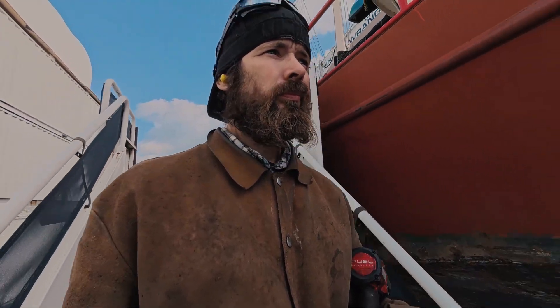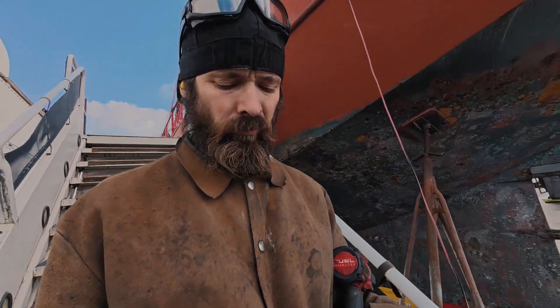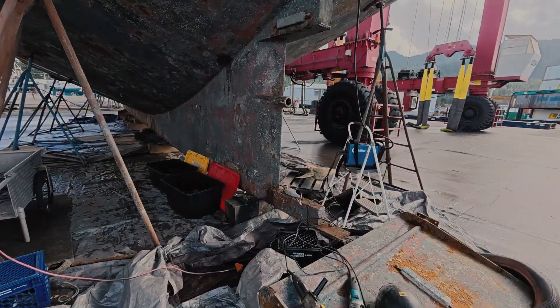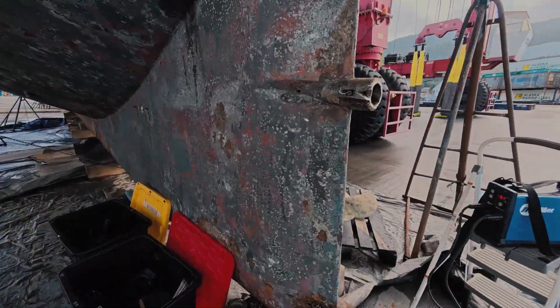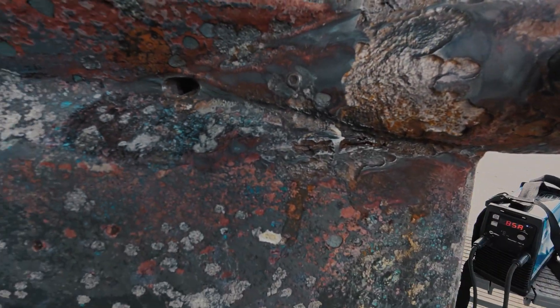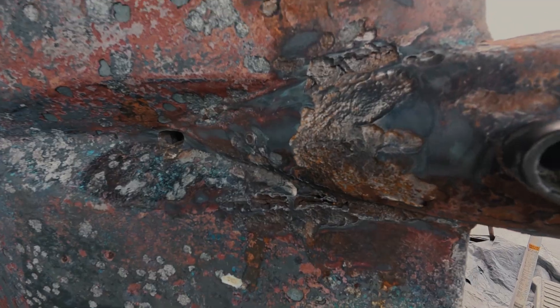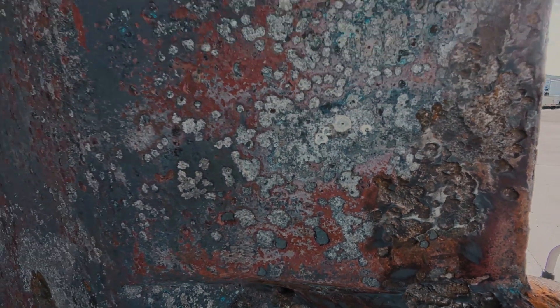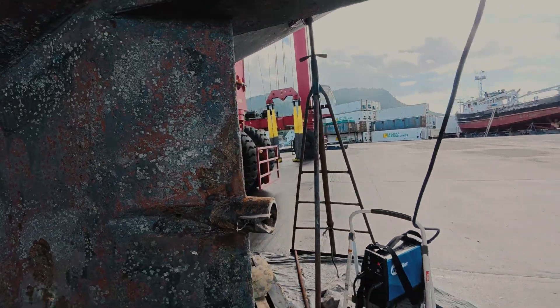Welcome back to the gypsy life. This is the Alaskan Gypsy, an 80-foot steel triple-masted schooner that we're working on in the shipyards in Wrangell, Alaska. It's got severe electrolysis damage. Here's an area around the stern tube — you can see it's got even some holes in there, and just broad distributed divots and pitting. That's the area I'm going to be working.